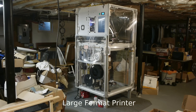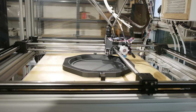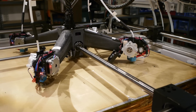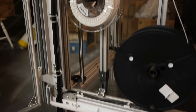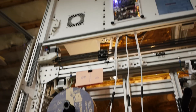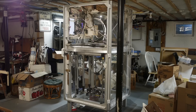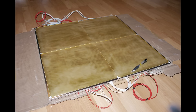This is my home-built large format industrial 3D printer with a truly quick-change tool head system with parallelized printing capability using up to four extruders at the same time. I designed it to be as big as I could and still fit it in our basement. It sits about a square meter on the floor and extends almost all the way up to the basement ceiling. The build volume winds up being two feet by two feet — that's the build plate — by about 30 inches high.